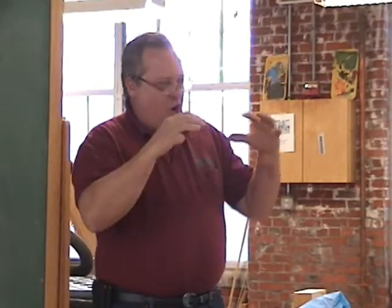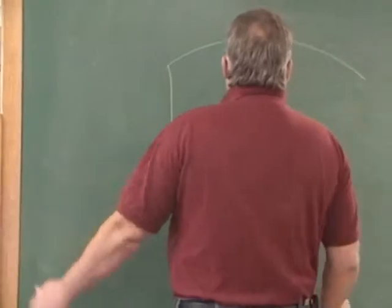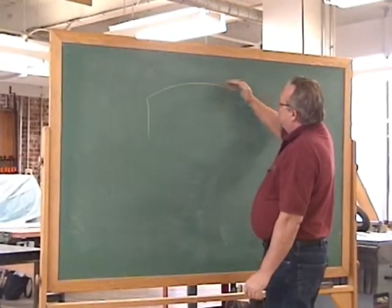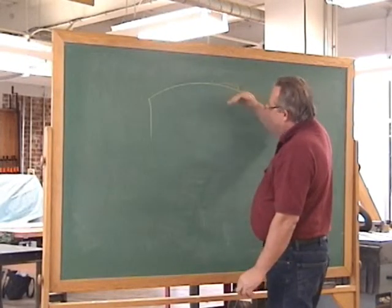Because it's a dome, it resists the deflection of the bridge rolling forward, or that bellying up behind, or the caving in front of the bridge. You see that all the time on acoustic guitars where the bridge rolls up. Because it's in a dome, you place the high point of the arch right in front of the bridge. Of course, that's exaggerated. Here's your high point. If your bridge is here, it's uphill here. It really resists that temptation to dive in here.